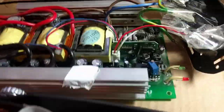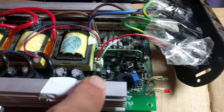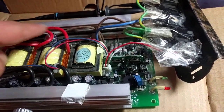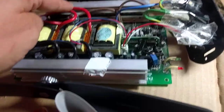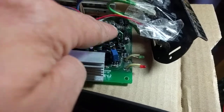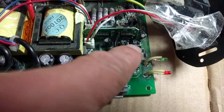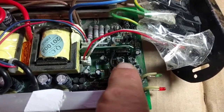This works much the same. In this case, what they're doing is they have two of these chips, because there's a low side switch and a high side switch. The low side switch will be switching this side, measuring a divided version of the 200 volts or 180 volts to make sure this stays at around 180 volts. The second side probably doesn't need any feedback — it just switches at a constant 60 hertz and generates your 60 hertz output waveform. These adjustable potentiometers here almost certainly let you adjust things like the output frequency — generally I wouldn't mess with them.